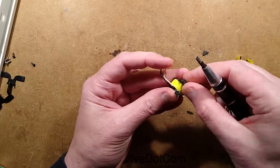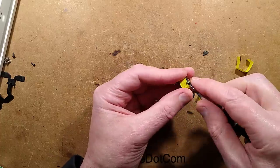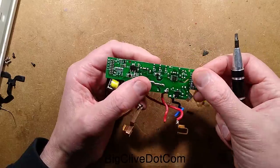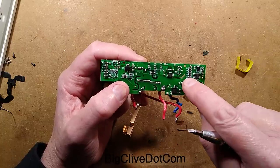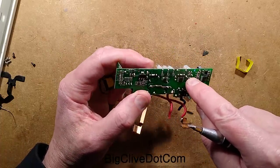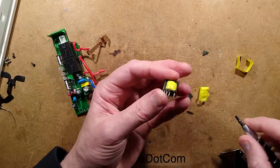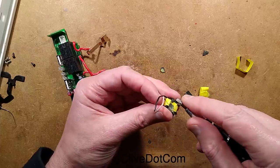If one of these sockets fails — if the power supply blew up — you could theoretically still use it. If you chopped off the mains voltage side bit that had gone boom, you could still use this module by tacking a couple of connections across the smoothing capacitors and running it from a 5V supply like a power bank. That would technically give you a standalone switch unit. I guess there must be 5V relay modules for switching — could be useful for stage or prop use.